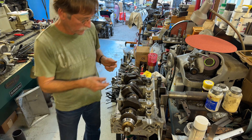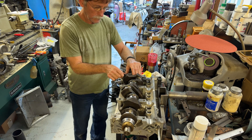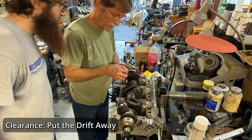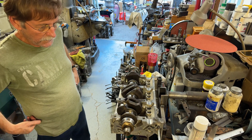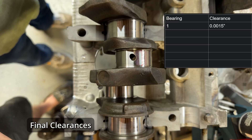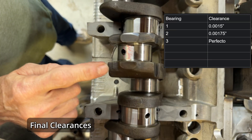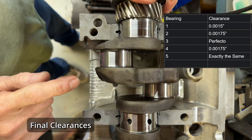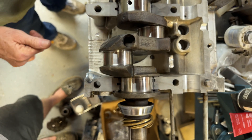One more check and we're calling it a day. I'm putting that brass drift away because I know it's going to be great. Oh yeah — just perfect again. Take the crank, polish it out, measure it, wipe it up — perfect. Okay guys, that's perfect. We're going to wipe this down. Number one, number two, three, four — it was in the oil hole, sorry — five and six. They are all perfect. This little engine is going to be wonderful.